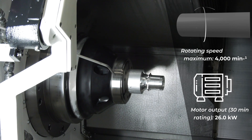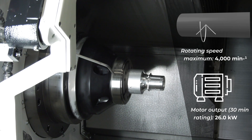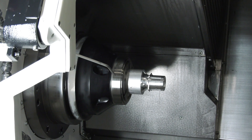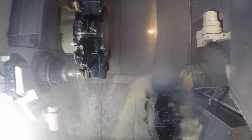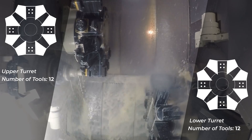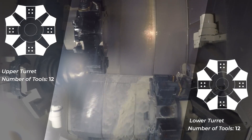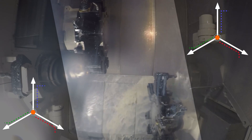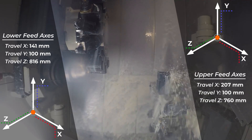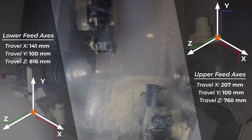It's not just that it's two machines back to back — it's two turrets that can work simultaneously on the same spindle. Rather than a machine that's like two machines back to back, which we call a Multiplex, this allows you to balance your operations from your first operation, transfer across to your second op, and have both spindles working independently of the turrets or together.